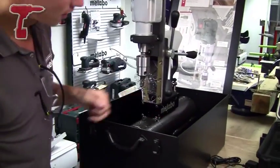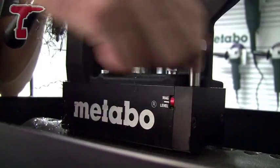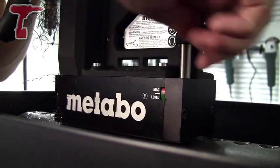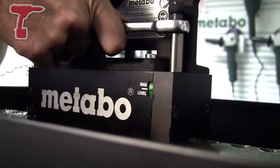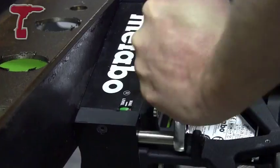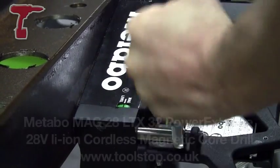The magnet is an independent magnet from the machine. The motor is powered by the battery, and it comes with a docking battery as a spare. But the actual holding force here is round the side — we have this lever that activates the permanent magnet. You can wind it in and out to vary the strength level depending on the thickness of the material, or if you just want to nudge the machine across to get it on the centre point for where you're going to drill.